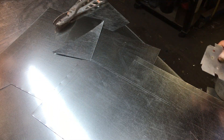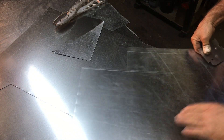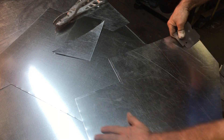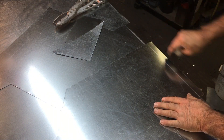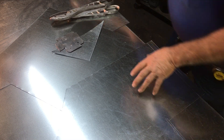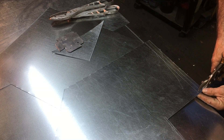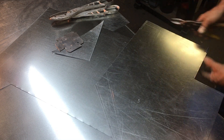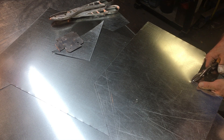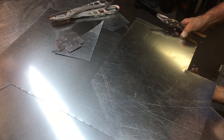We're going to have a double hemmed 90 on this piece, so we need a half and a one. We've got a quarter inch up the heel wrapper, a quarter inch on the toe wrapper, and up here we're going to have a drive, so we'll get a half and a one up there. Now we'll notch — bring it in straight to the one, knock that off, and come into your intersection of those two quarter inch marks.